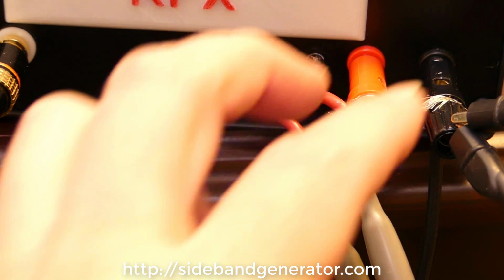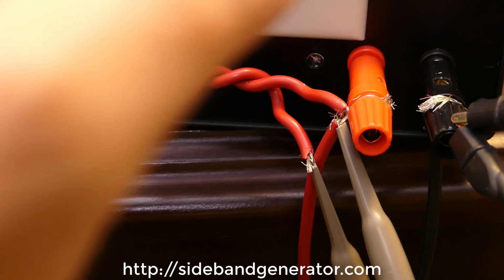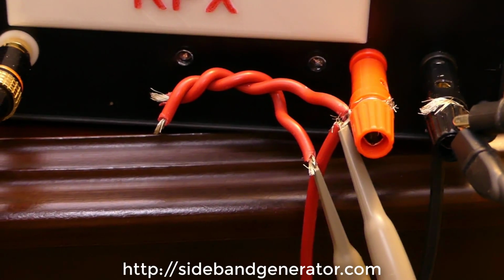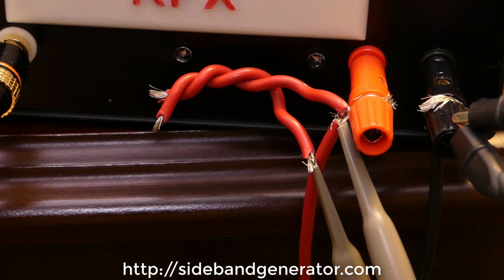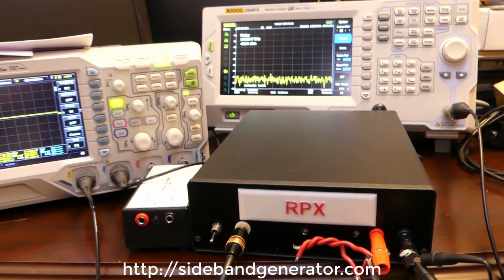And there's ways of taking this output through capacitor plates. You can take it into an antenna, and you can receive it by a RF antenna going to the input of the spectrum analyzer, and you can look at it that way too. Okay, so now that we know how to properly couple it safely to this using what's known as a gimmick, capacitively coupled twisted wire setup, we're going to look at the spectrum analyzer itself.